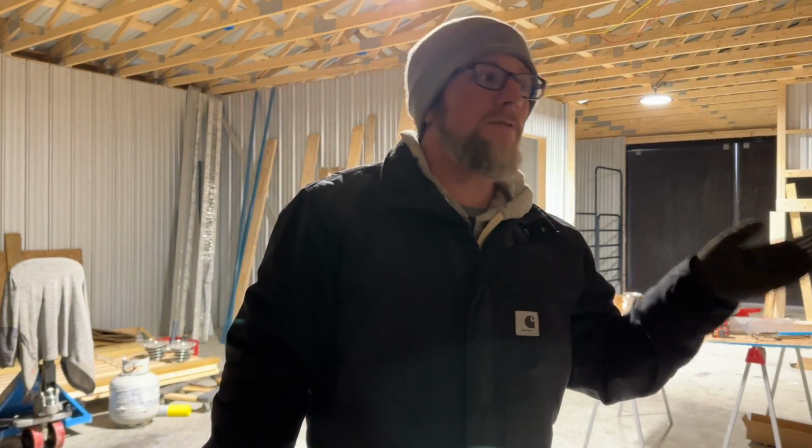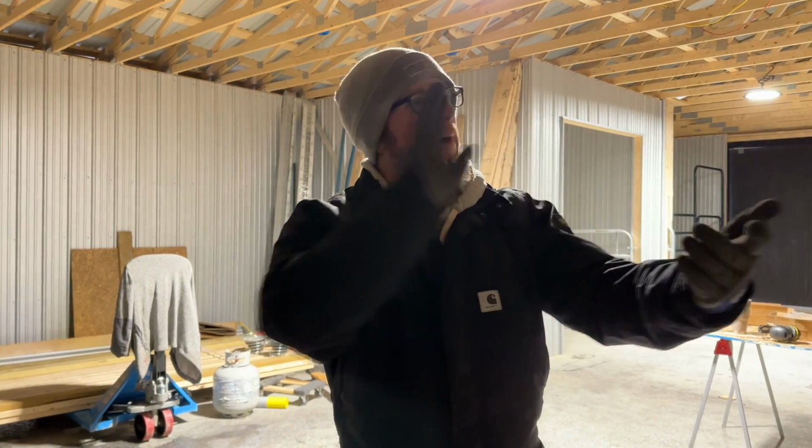We got some pretty big service wire, so it's going to be kind of stiff. I want to come through the back of the service box and not through the bottom or the top, because the service box is going to be protruding out from the wall. It'll take a little bit of finagling, but we'll get it. I kind of have to work all that at the same time. So let's get this box figured out.